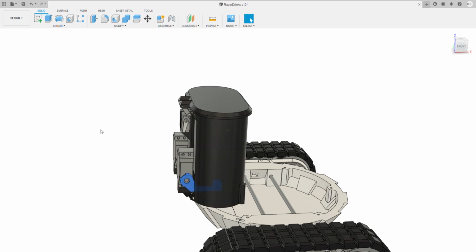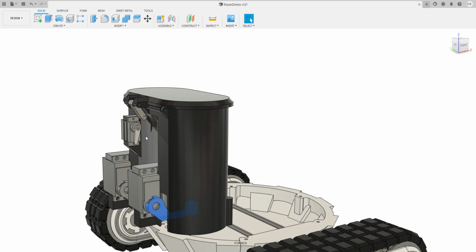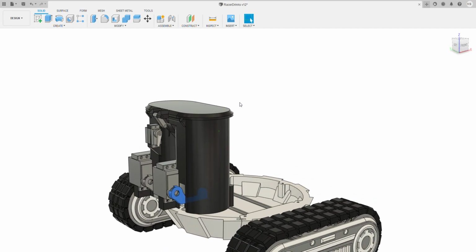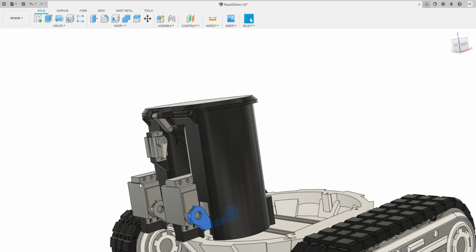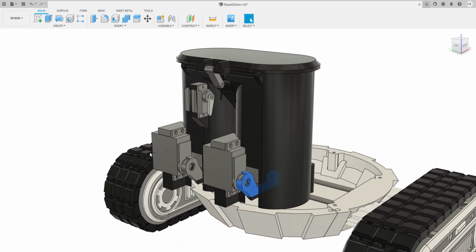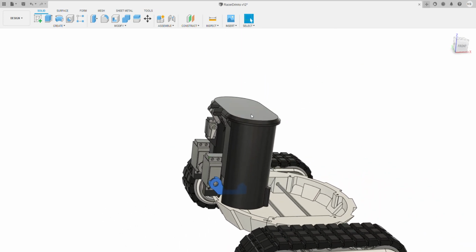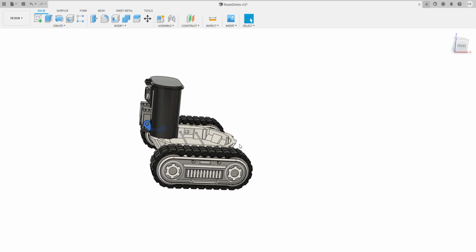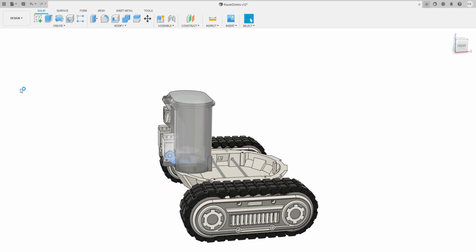The way I configured them on the RC is, you've got your drive stick on the right hand side, and the left hand side, left right, turns your dome. I used the up down stick to open this lid, and then I used the two dials on the FlySky remote control to lift the cans. So actually it doesn't require any electronics, any Arduinos. It's literally running straight off the RC, and I'll cover that in a little bit more detail. So that's your can lift.